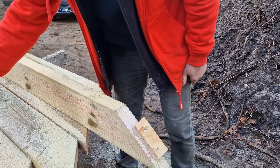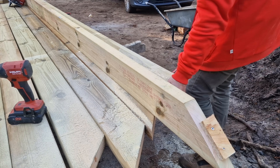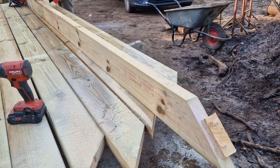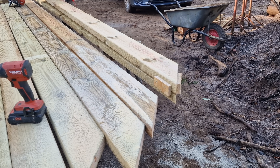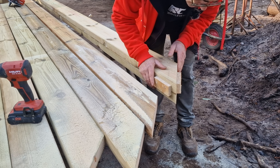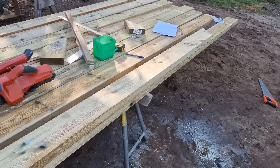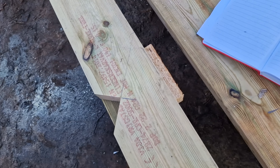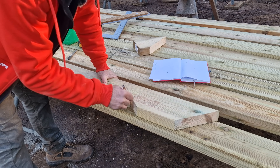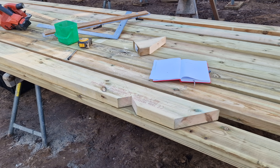So that's really solid. When I mark the rafter out now I'll just drop this template or pattern on top, pull it like that, and even from the other end when I'm pulling, it's going to locate it exactly where I want it - makes it super easy. It holds it all really nice and flush, then I just come down the other end - it's holding on the back of the rafter nice and flush - and then it's just a matter of marking everything and cutting it. I'm going to repeat that process, get the whole cut done, and then we'll crack on beveling the bottoms.